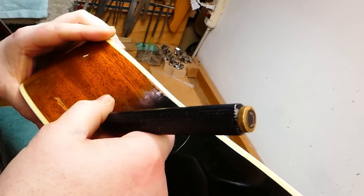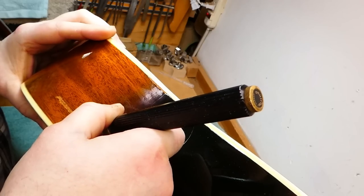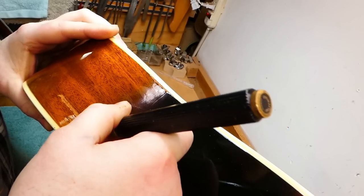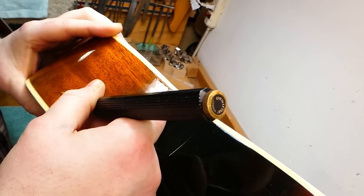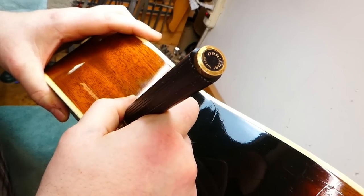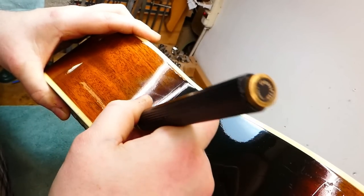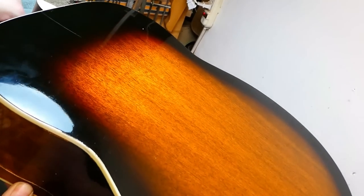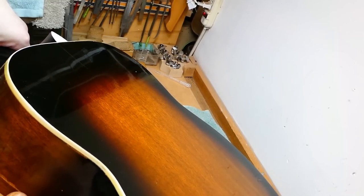Out comes the scalpel, and I'm going to cut in at an angle, creating sort of a scarf joint between the two halves, running directly along the line of the crack. It might take multiple passes. I'm really only removing like a hairline's worth of wood, but it's the stuff that was impeding progress. That's much closer to flat than it was — still not perfect, but better.